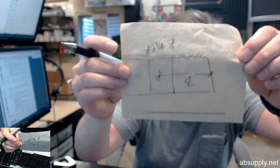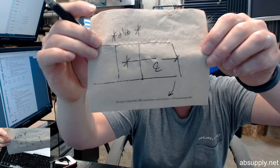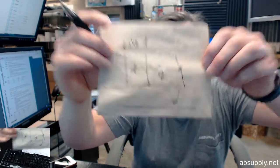If you're looking at a cross section of the door, here's your door edge, and the door will swing in that direction. Okay, edge of the door to the center of that 2 1/8 inch hole is going to be your backset. If your door is square edged, it just doesn't matter where you're measuring it from, and it's likely that it is, but it's also very likely that it is beveled. So your dimension, if it's beveled, will either be like 2 7/16 or like 2 5/16. So just keep that in mind.